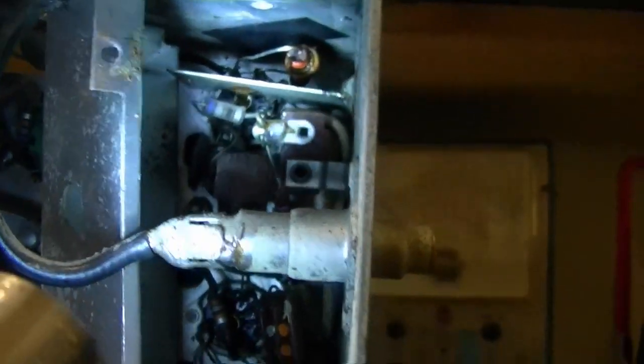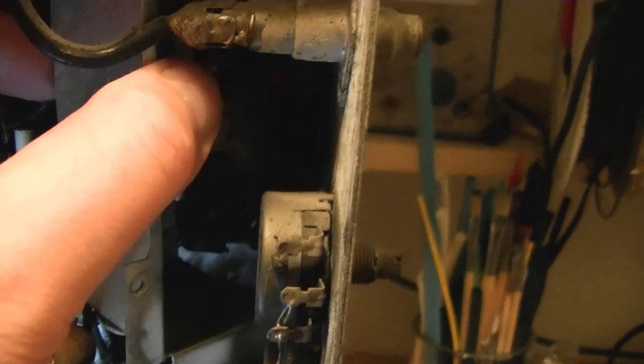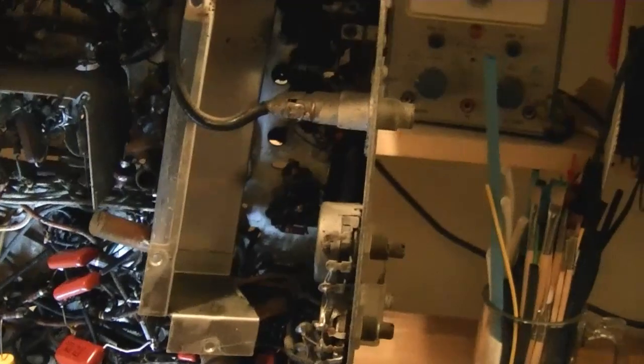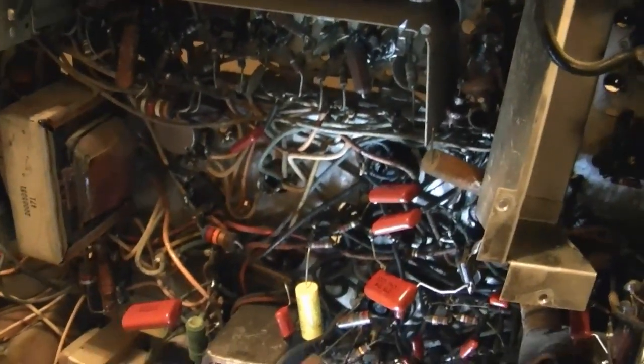Inside I can see some resistors to check, mica caps, some coils, and another mica cap. I think I can muscle this out of the way - even just like that it's pretty good enough. I'll replace those caps. I still haven't touched the electrolytics yet, so to replace these last few paper caps, I'll tackle the electrolytics, and then finally try powering the setup.